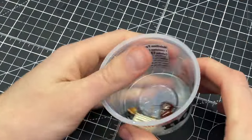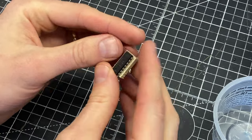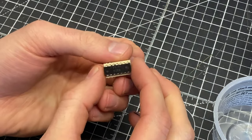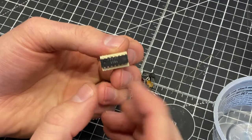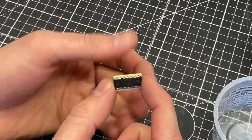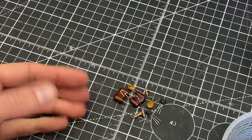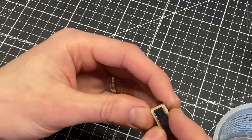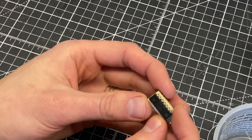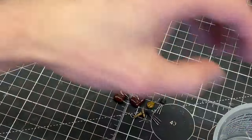The original operational amplifier IC kind of worked — once the volume control was bypassed, one channel worked but the second channel only kicked in when probing around the pins. These can become intermittent, so I replaced it with a Burr Brown IC — a modern op-amp that has the compensation network built in, unlike the original which needed a special external network. This allowed me to pull a bunch of peripheral components that were no longer needed.